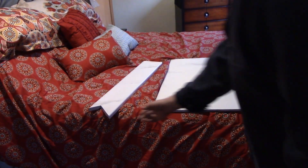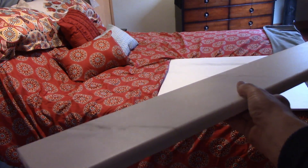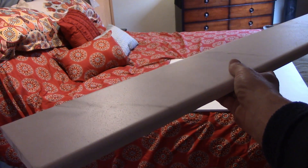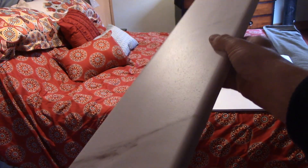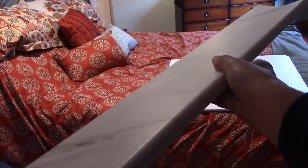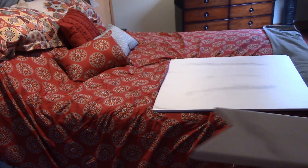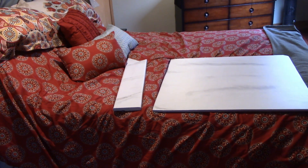The granulars in the non-skid finish came out really good — it's like somebody sprinkled salt across it. It's going to create traction. If you feel it, it's really rough, so when you have wet feet and step on this it's got traction. I'm just throwing down the initial bead of caulk and then I'll throw five blobs of construction adhesive, put the board down, and go back with the white caulk around the edges one more time.